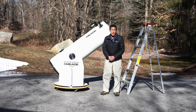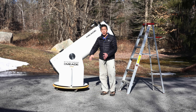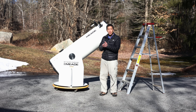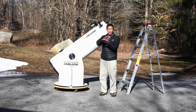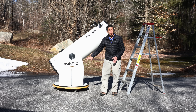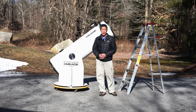You can see the owner has taken some remedial measures. The ground board, which should be white, is actually a wooden tabletop they found at a big box home improvement store. The two materials you need are Teflon and flooring laminate. The Formica on your floor actually winds up being a really great telescope material, and the dissimilar properties of the Teflon and the Formica are very good for the stiction you need for a telescope. When you get under there, the Teflon pads are going to be too small — you'll have to put bigger ones underneath.